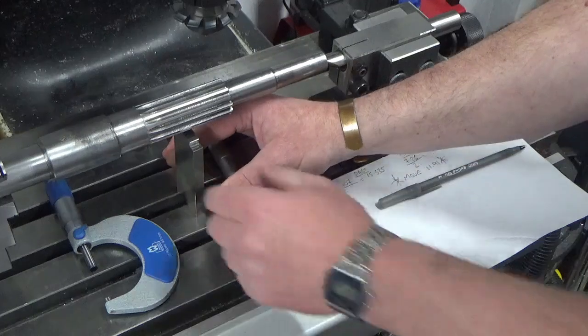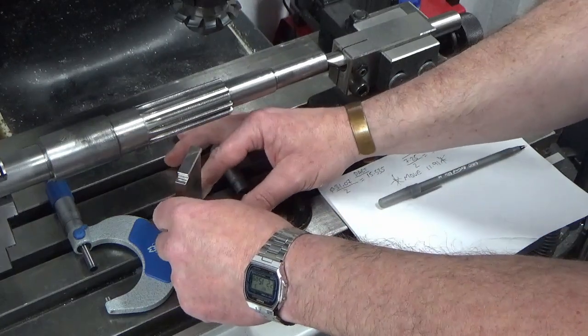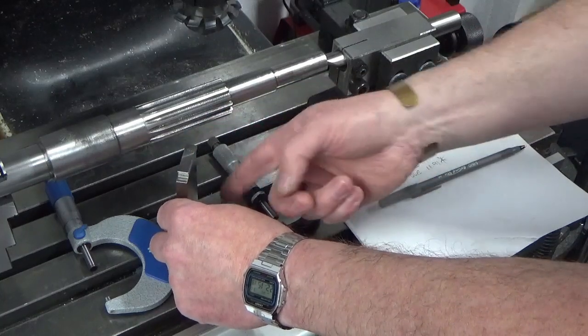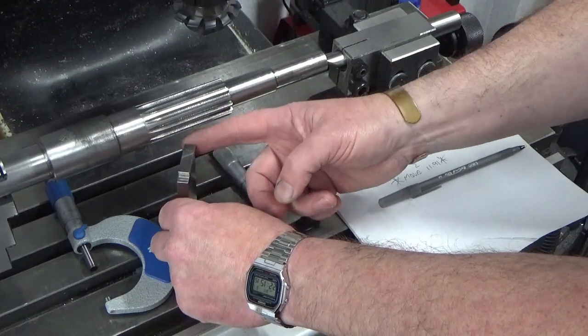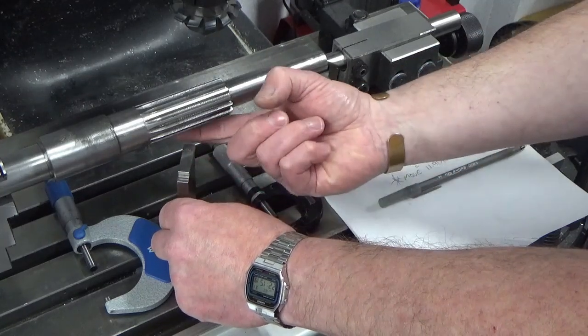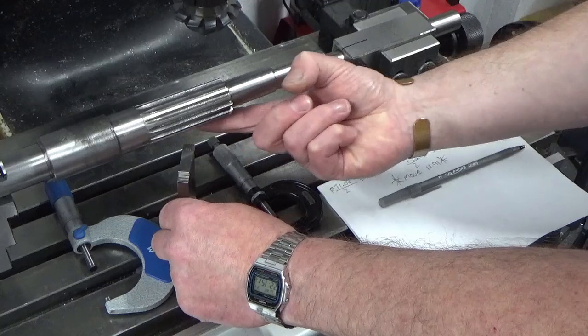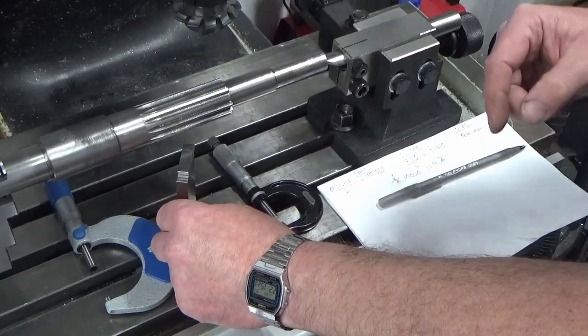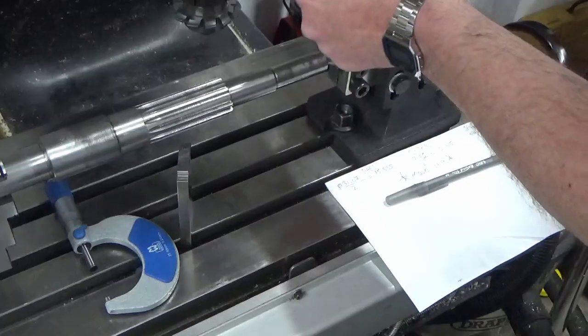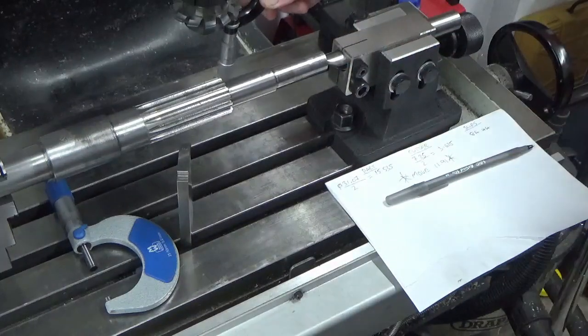Nice feel under there. So I know what the distance is. Well, it doesn't really matter. I don't measure the distance from the underside to the table. That's unimportant. All I know is this slip pile, the top of that is coincident with the underside of the splines in this setup. The next thing I've done is I've used a 0-1 micrometer and I've measured the thickness